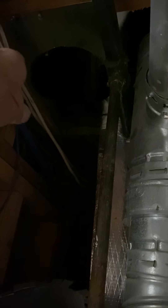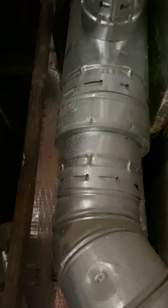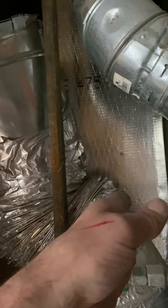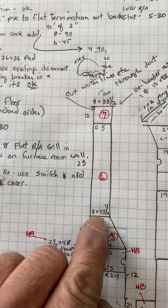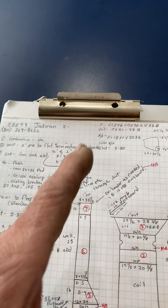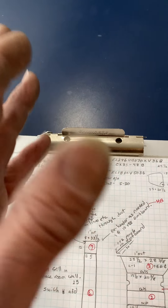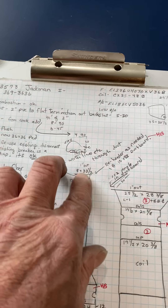Just the one floor grille. Anyway, if you can, when you get up there and see what's going on, maybe cut a 4-inch hole through the joist — or whatever is feasible depending on what the duct does — we just want to get as much air as we can. You've got this gas line right here in the middle, so I went from a 12-inch drop to an 8-by-33-and-a-half. The bottom was back a couple inches, and that'll pick up our two joist spaces. It's kind of hard to measure, so if I'm over a little bit, just seal off what you need to on top. That should come right down in between.